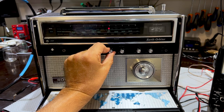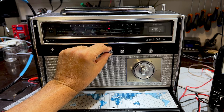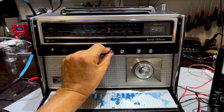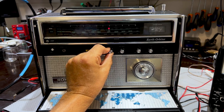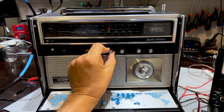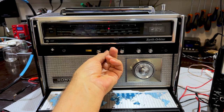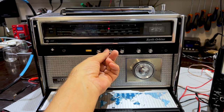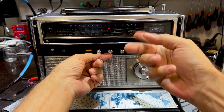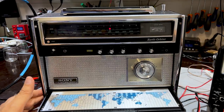So what it means is that I should be able to leave it there, adjust the tuning of that coil till I get this. Put the volume up. That's the other way. That would be zero beat. There. You should not hear the tone at all. Okay, but we want this characteristic. We want this over here, because that's where they tell us the center point is, okay?